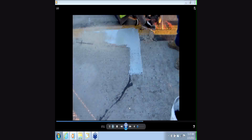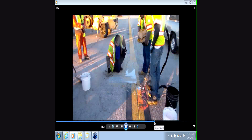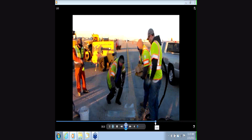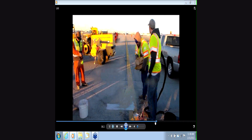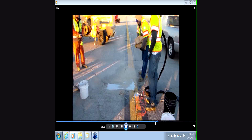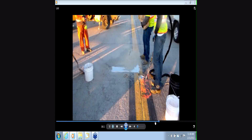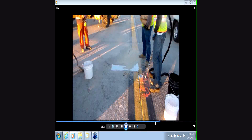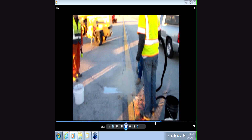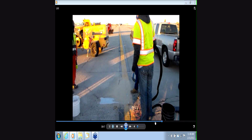We're throwing on more topping sand — and there we have it. Total time for this LAX repair from start to finish was probably 12 to 15 minutes. The topping sand is the last application. It was particularly cold at LAX that morning — starting in the high 30s, up to the low 40s at this application — so after the final pass of polymer we had probably a 15-minute wait until fully cured, but certainly not hours.